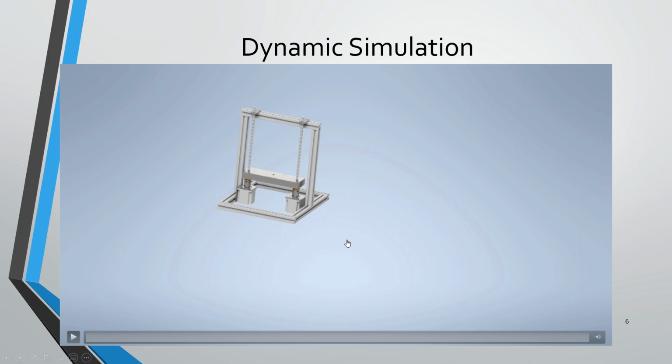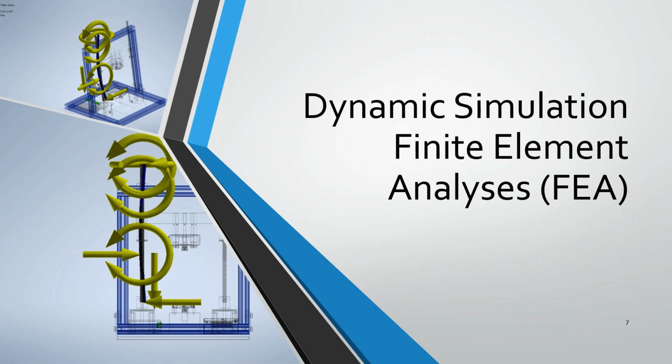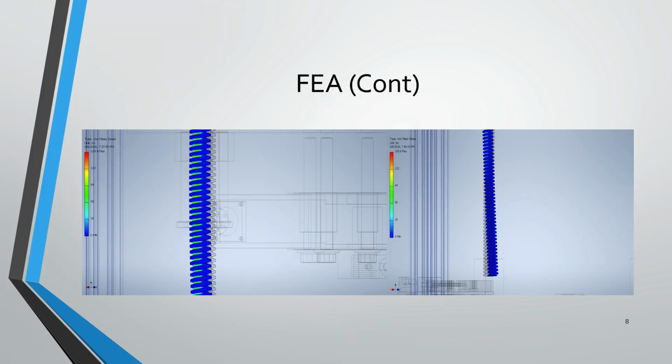So what does this tell us? Basically what this tells us is the next part of the experiment, which is the dynamic simulation finite element analysis. Also, this is known as FEA. So from the FEA results, we were able to determine some of our maximum stresses. As you can see, we don't really go into the red at all. Our part is basically in the blue, which when considering things like von Mises stresses is very, very good. Highest stress would be anywhere between 56 to 84 KSI in our parts.